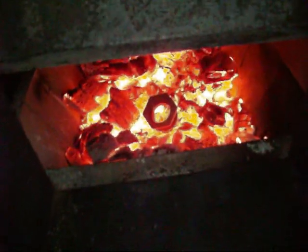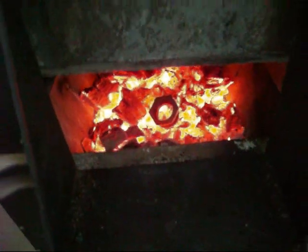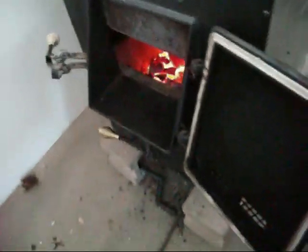I know I said earlier I was thinking of grinding the galvanization off that 2-inch to 1.5 inch reducer, but well, I got thinking, well, that zinc burns off at somewhere around 800 degrees or something, I think, so just set her on the bed of coals and burn it off. And clean it up with the wire brush and put it together. Be just the same as putting in a black steel one.